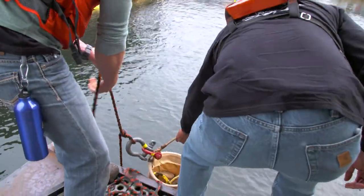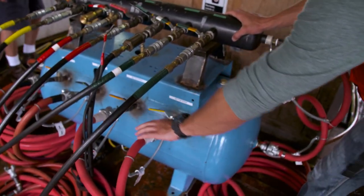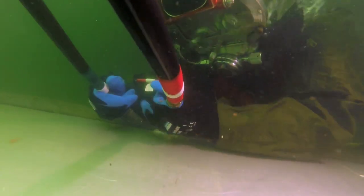We fabricated the vessel and built it in a way that it has compartments that can be pressurized to help assist the lift. We have air going through our manifolds down to our pontoons, and we also have two voids in the boat where we can capture air to help with the lift. These red hoses are the CP hoses — they connect to the bow and stern sections of the boat to circulate air into the sealed compartment. The other hoses run to the pontoons; once turned on, air circulates into the pontoons, pushing the water back out, and that raises the boat. As long as you're pumping more water out than is getting in, you'll successfully salvage.